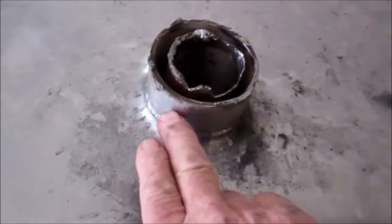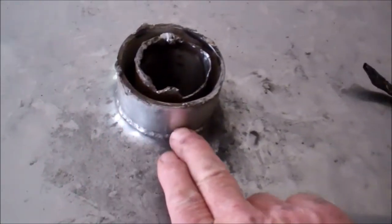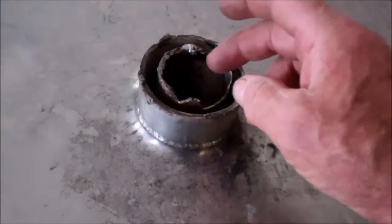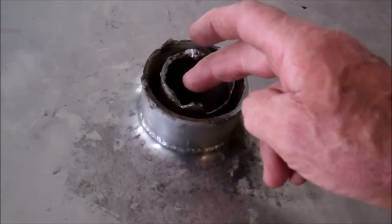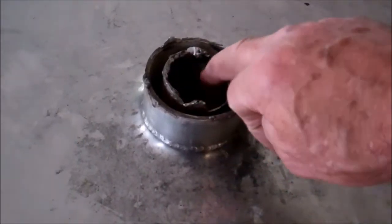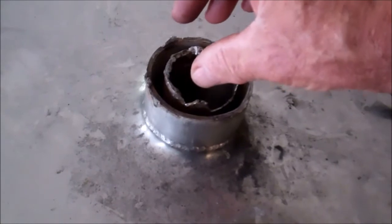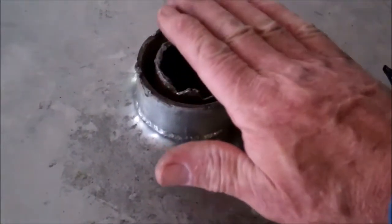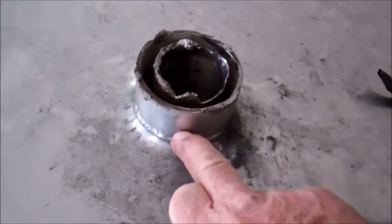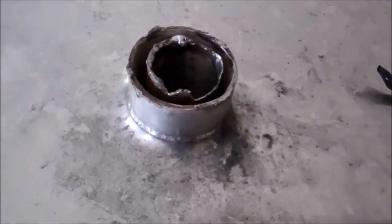What I'm going to have to do is cut the outer tube off about here, take it away, then I can get at the inner tube, cut that off square at the top. Then I'll weld an extension onto the inner tube to bring it back up again, and then weld the outer tube back on and make a new flange.